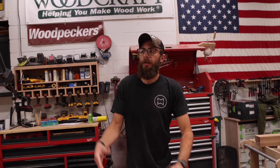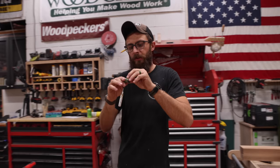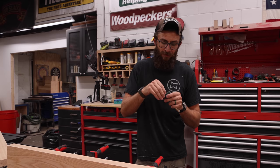Unfortunately I'm making lemonade with what I have, but I think this combination will glue up nicely. These give you a nice even glue layout — you don't need that much glue when gluing up. Someone told us it's only one molecule between two pieces of wood that's enough to make it stick, so don't go crazy. Because they're just two thick boards, I'm not gonna do any biscuits or dominoes — I don't think it's necessary for a project like this, but you could if you're worried about alignment.